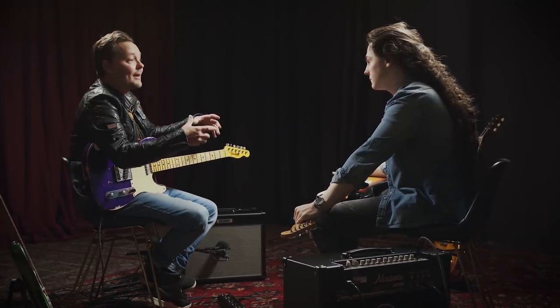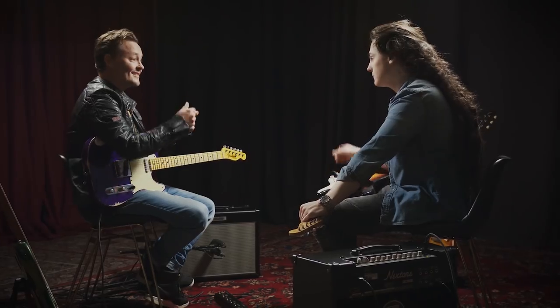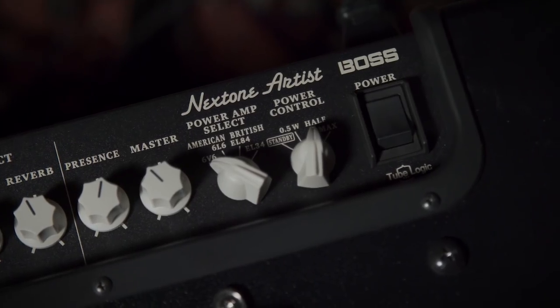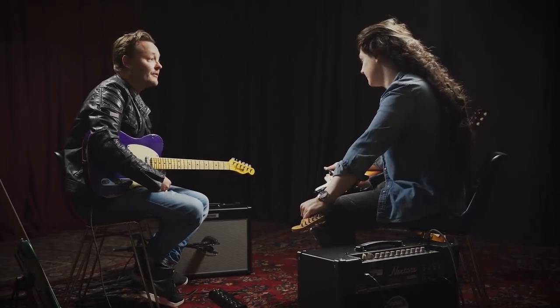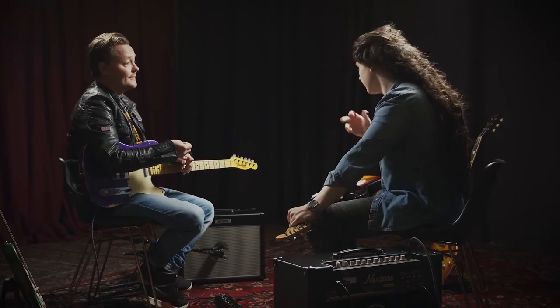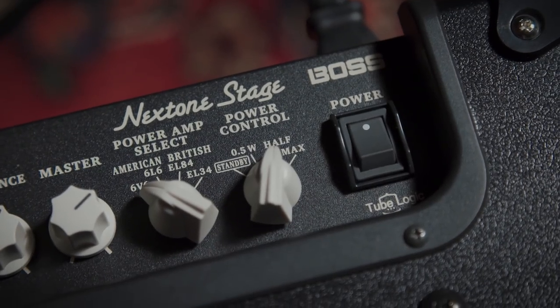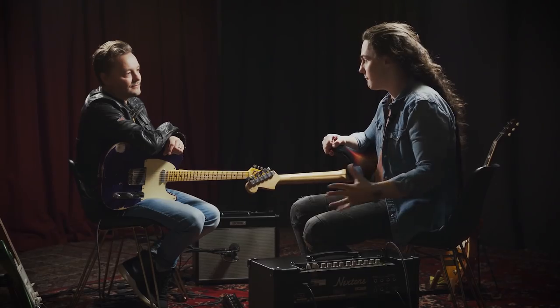Typically a normal amp would have one power amp circuit in there, which dictates how the amp feels and all of that stuff. So this has got four analog class AB power amp circuits built into it. You've got your 6V6s, your 6L6s, your EL84s, and your EL34s. So using the latest evolution of tube logic, using some discrete analog solid-state circuitry, which means that every time you change the power amp selection, it totally revises the amp from input to output.